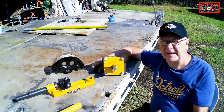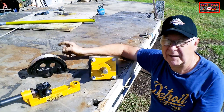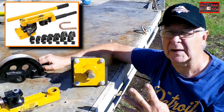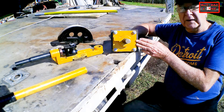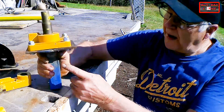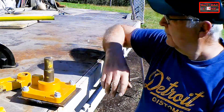The top-notch manual pipe benders in Australia give you enough leverage to bend 25mm pipe by hand. They cost $2,000 or more, which is four times the budget for this whole Motocana special — so that was out of the question. Instead I bought this cheap one online for $200 delivered. I've had to make four improvements to it, as I thought I would. It's designed to be bolted to a bench, but there's always something in your shed that fouls the pipe when you're trying to bend it. So to give myself maximum free space, I made a bracket to mount it onto the tray of my race car tow truck — that gives me a huge amount of free space. That was my first improvement.